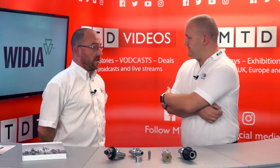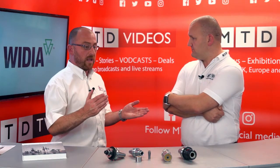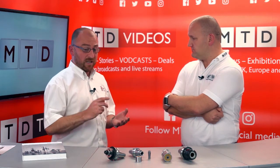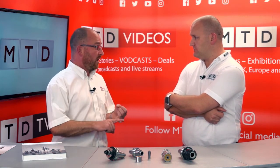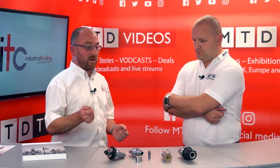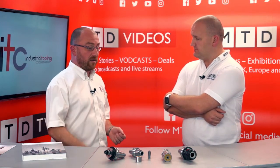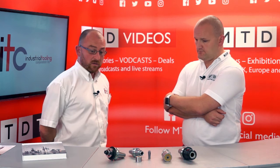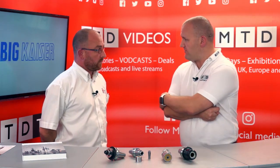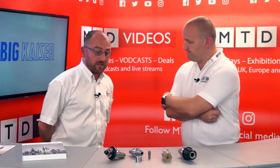So what's the advantage? The advantage is that you don't get any kind of vibration that you get with carbide, whether it be indexable or solid. Two things kill carbide in my opinion: wrong speed and vibration. Anything we can do to get rid of that means we can run at higher feed rates and get more stable cutting parameters. And I noticed the nut appears to be ground as well. Why is this? Yeah, the threads are ground internally.